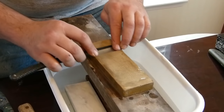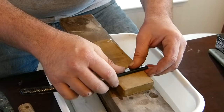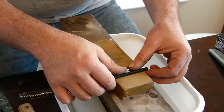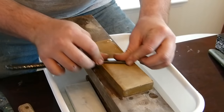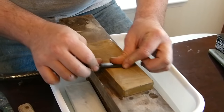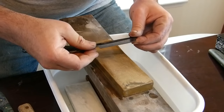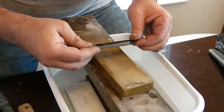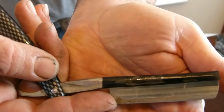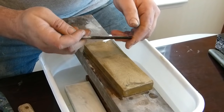I'm going to turn it over and use my thumbs because of where I'm at. What I'm trying to do is give even pressure across the whole razor. These things are flexible and this is a thin edge, so we don't want to push down too hard in one spot — give equal pressure. Now we've got equal wear across there. The heel is shined up, the front is too. You can see some of the filings and the slurry that's made — this has got steel in it, so it's doing exactly what we want.